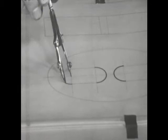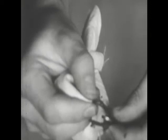Drawing pens must be kept clean at all times for satisfactory work. Cleaning before readjustment or refilling prevents the ink from gelling in the pen. Folding a corner on the wiping cloth permits drawing the cloth between the nibs without disturbing the setting of the pen.